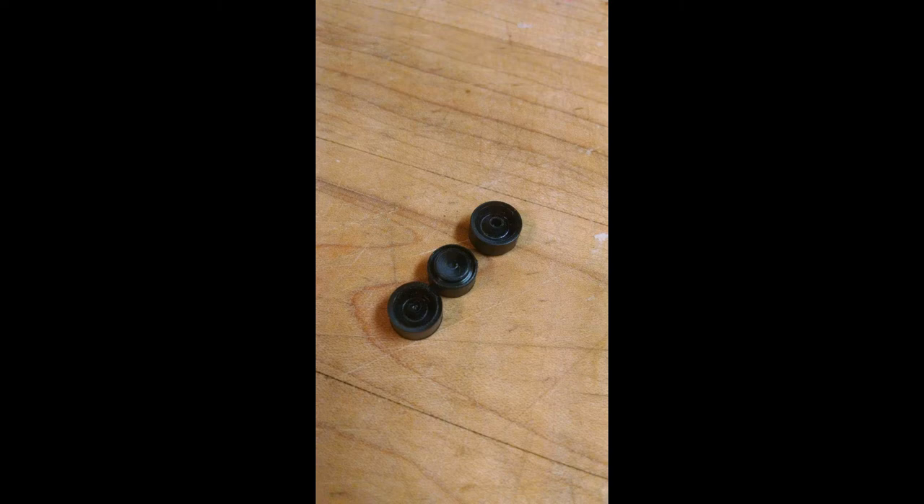Hey guys, so as you saw in that previous video, my gun ended up having a malfunction — nothing serious. What it ended up being is the QEV: the diaphragm inside the QEV would cock at a weird angle after firing and it wouldn't seal the barrel. So all the air was just escaping out of the SodaStream bottle, past the rubber diaphragm and out of the barrel. I made that video about five days ago and I've been messing with a couple of things including a new design. I'm going to show you a picture of three new diaphragms I was making for the QEV.